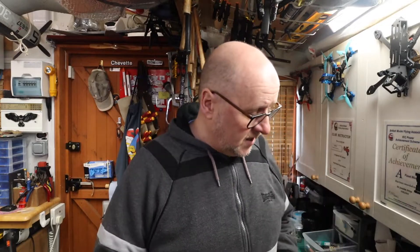That actually works really fine and there is fuse protection on it. So that's my tip of the day - test anything, same as you used to do with flight control boards. Test it before you solder to it and put everything in. Before you go stripping your machine down, just test the board you've got with the display you've got. I'm now going to put this together. I'm using these JST plugs from the modelling hobby - 10 amp DC. They're little red plugs with male and female connectors. I've connected them already so it's time to slot it all in and plug it in.